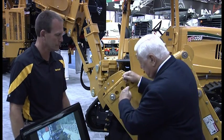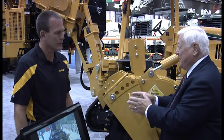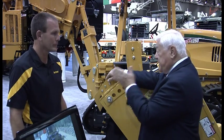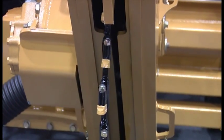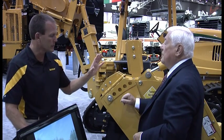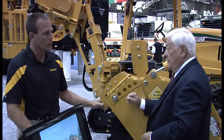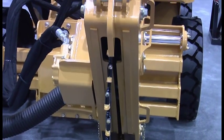When operating in a lowered position and cutting, there is a guide on it that will guide the operator to maintain a straight line and keep it off the cutting surface. It's really critical when cutting along a lot of these roads that the cutter wheel doesn't get into the concrete curb — many municipalities don't want that, to preserve the integrity of the curb itself. Once the wheel is cutting in the ground, this cutter wheel guard will ride right alongside the curb and prevent the cutter wheel from getting into the concrete, avoiding excess wear or damage to the curb.